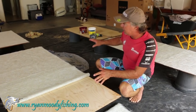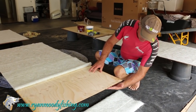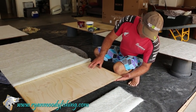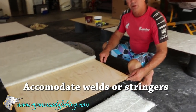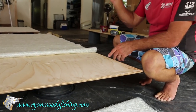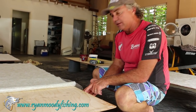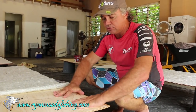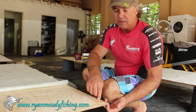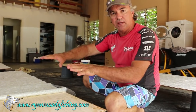What we've basically done is I've cut all my pieces out here and I've got them ready to go. On the undersides, I've bevelled the edges to 45 degrees — not all the way up to the top though, from about halfway down. That's because I have welds along the floor line around the sides of my boat. In some cases you'll also have aluminium stringers in some boats, so you may have to make a little cutout or just an angled piece underneath where it touches the side of the boat. You want this floor to be screwed down tight to your stringers — you don't want the edges lying on top of a weld.